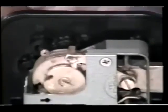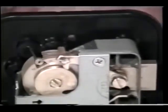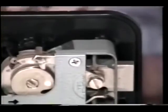The probe has an eccentric tip, which we rest on the furthest wheel pack and then dial it. As the slot comes around, the tip drops into the wheel pack. You record this number. Now this sequence is then repeated, the correct dialing sequence, for every wheel pack. You'll feel the tip drop in as the slot comes around three times, and you have a series of three numbers. Now, this is quite easy to feel.